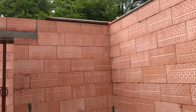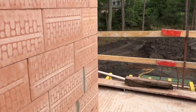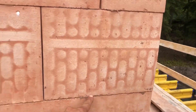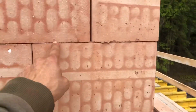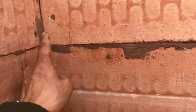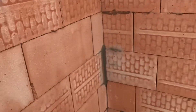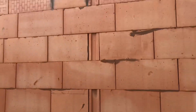Some negatives with this system: one of the things is you can't bond a wall afterwards. You can't leave a vertical tooth — it's not possible with this system because you don't have a joint to work with. So I always try to bond my walls, but to bond your walls I need to set all the profiles. I can't do it later — you can't leave holes to put a brick in to bond it afterwards. You need to make the wall all in one time, so that means I put all my profiles.